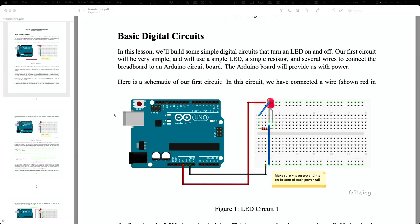electronic stuff, we're using direct current, not alternating current. So has anybody ever changed like an outlet or a switch in your house? Yeah. So that's AC. Okay. So typically when you open up an outlet plate or something, you're actually going to see three wires. You're going to see a hot, a neutral, and a ground. But there's no real difference between plus and minus, because that's the whole point of alternating current, is it alternates.